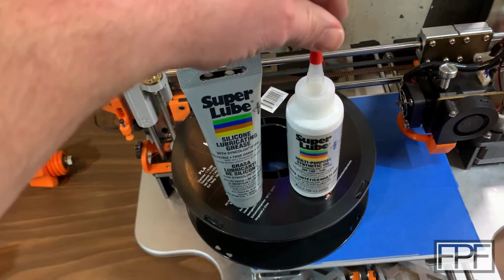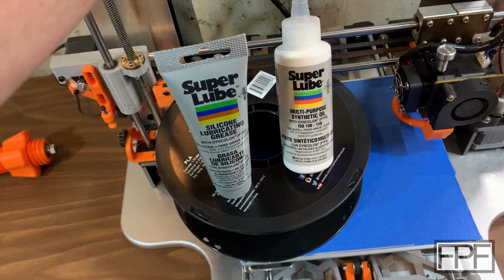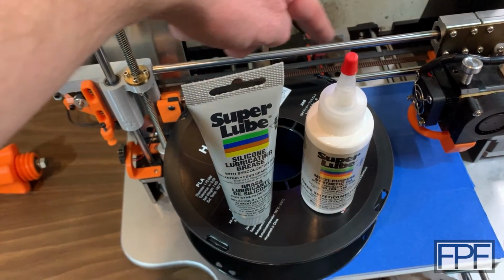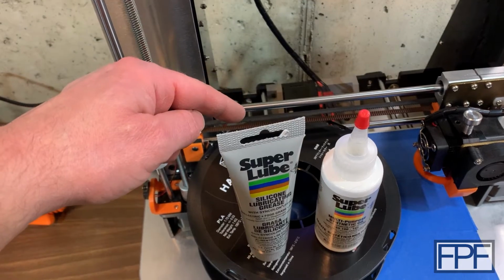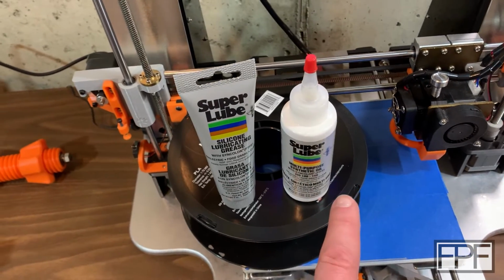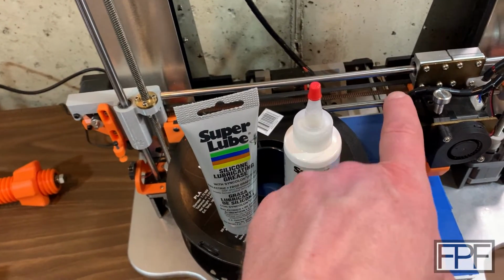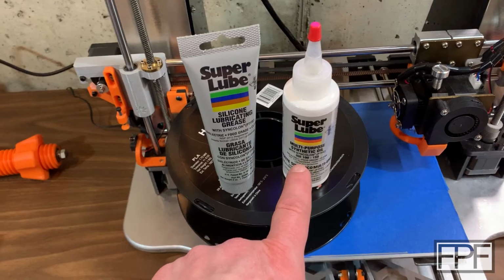that you own. This stuff is like an oil. It's a synthetic oil with Syncolon PTFE in it. This is the stuff that I use on all of the smooth rods, either the ones for the Z or for X and Y. Don't use this on the carbon fiber rods on a Bambu printer, but on any metal smooth rods, you want to use this stuff. And I'll link both of these down in the description of the video.